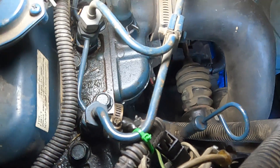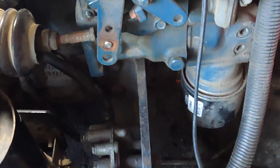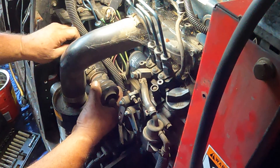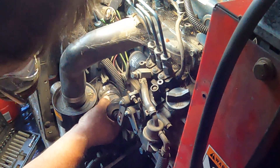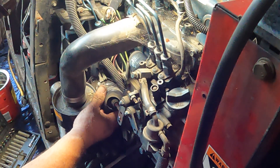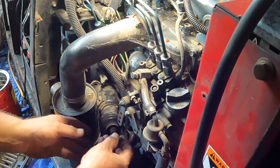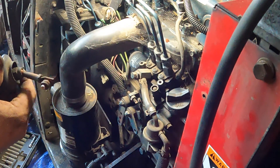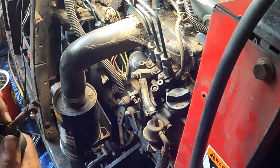What I'm going to do is just tap that with the hammer and it comes out. When you put it back together you're going to have to press it back in a little bit — that snap ring has probably wallowed it enough to where it's hard to come out. In case I have not mentioned: disconnect the battery before you start doing anything electrically, whether it's the alternator or the solenoid — always disconnect the battery before you do any electrical work. Pop that out. Now the shaft's going to come out with the solenoid. It's not in the greatest shape, and it pops right out. Just leave it all connected because it was adjusted. Might spray that with some lube.